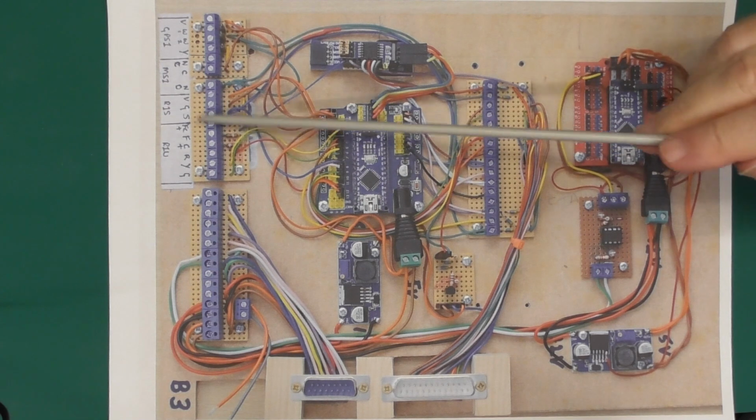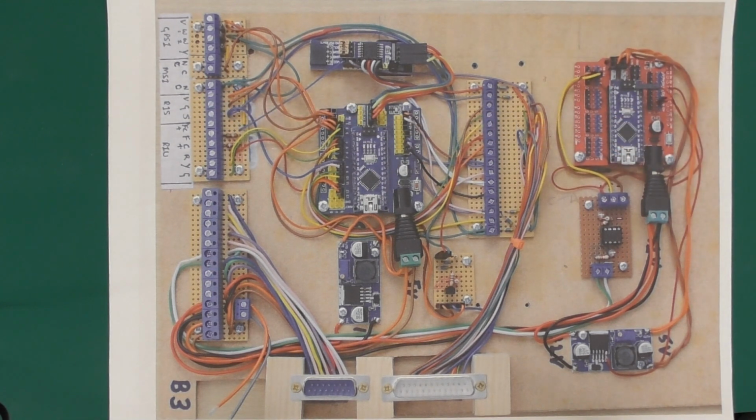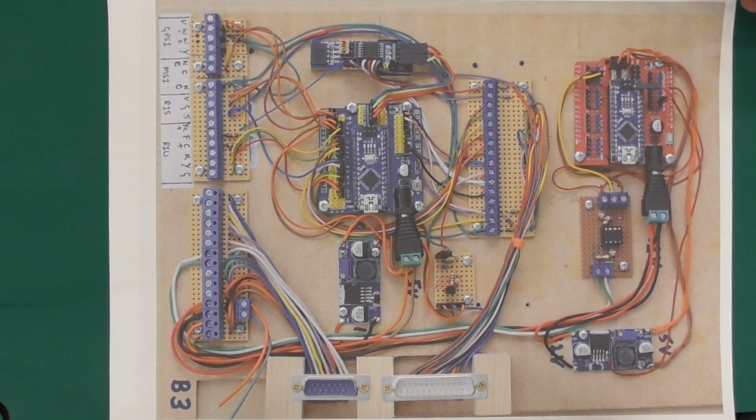The sensors that are connected to here take 40 milliamps each. They're the little things that you've seen before. I don't have one laying around, but they're not on this board. They're bolted next to the track. I've got 23 of those in the signalling system, and they are taking 40 milliamps all the time. They don't switch on and off. They're always on. So that's 23 times 40, which is a lot more current. So I'm pushing 3 amps on my signalling worst case.